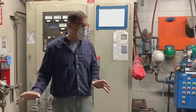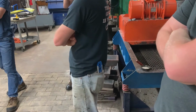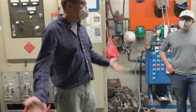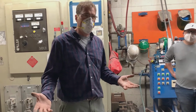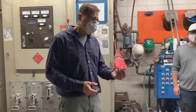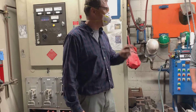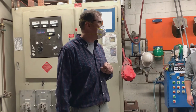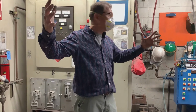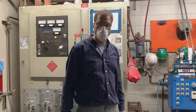So there's a huge amount of energy. Those will have to get shot blasted before we pour any metal into them. Let's just get in the habit of doing that. In the middle of the wintertime, we could probably look at it and say, yeah, it's probably okay. But the moisture, the water hydration of rust on a thin layer of rust like that, is enough. It expands 1,000 times its size. So if it's a droplet of water, it's 1,000 times. It's like this big then, right? And it goes from there to there in like a millionth of a second or something.